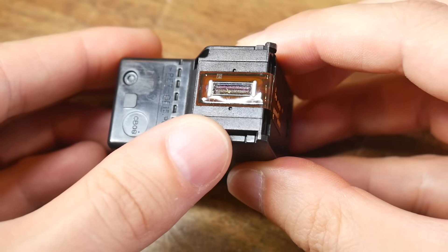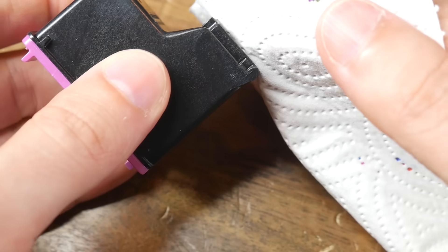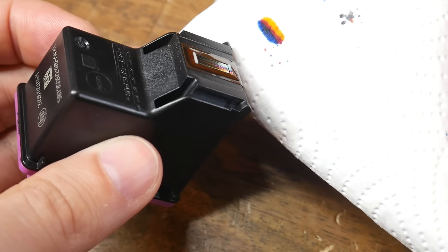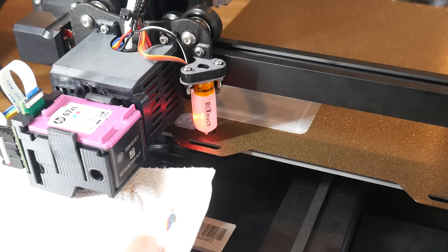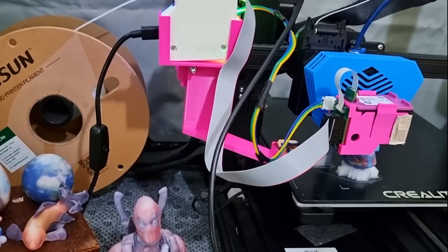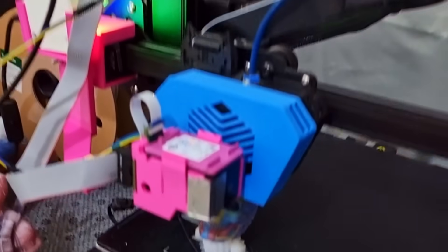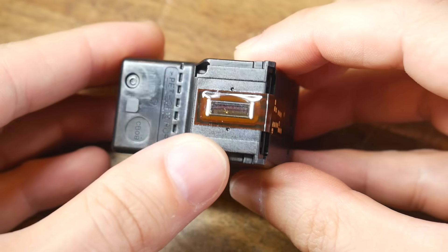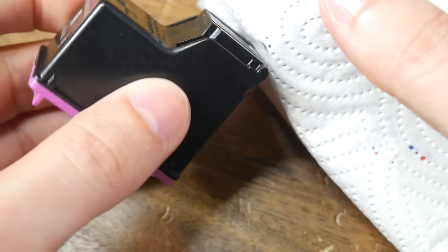Let's talk about the cartridges — the tips tend to dry up, and this can be problematic. The solution is wiping them with a little bit of paper towel at the start of the print, which dislodges anything stuck there and draws through more ink, getting everything flowing. At the moment, the printhead pauses to allow you to wipe it before the 2D color is applied for layer 1. However, you don't want to be doing this every layer because you're going to waste a lot of ink. Jacques has a wiper that automates this process, and there's nothing to stop users from adding the same type of system by tweaking the before-layer-change G-code to wipe at specific intervals. Temperature and humidity will dictate how soon everything dries up, so some user tuning might be required.